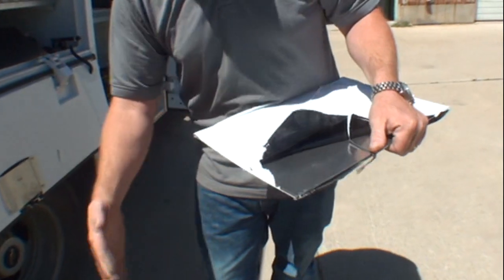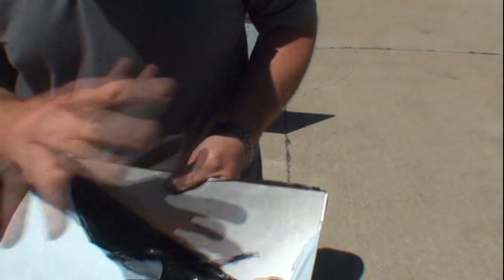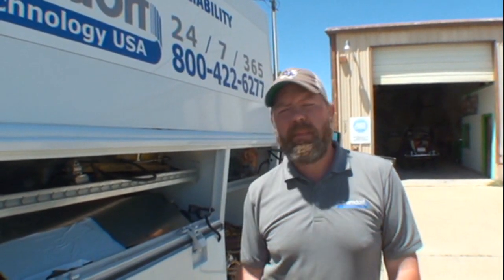When this thing comes around the drum, a scraper blade peels off their product. They come to us when they want to replace belts in full length. These are patch panels — I'm headed to Oklahoma right now to help a customer that has a three-inch crack. The belt is about 400 feet long, they make rubber tires, and it's about five feet wide. It's got a three-inch crack and nobody can weld it — we're about five technicians in the whole United States that do this.